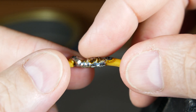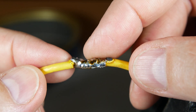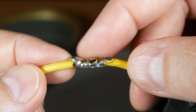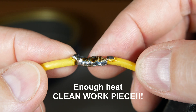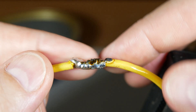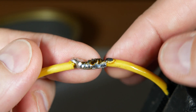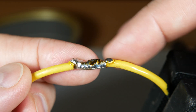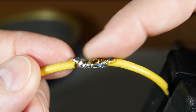So what two things did I do right? Well, the first one is that I had enough heat to saturate the joint, but the most important is that I started out with a clean workpiece. If you work for NASA, this is absolutely unacceptable, but if you're just doing a repair to your car wiring, boat, trailer, something like that, this is a passable joint.